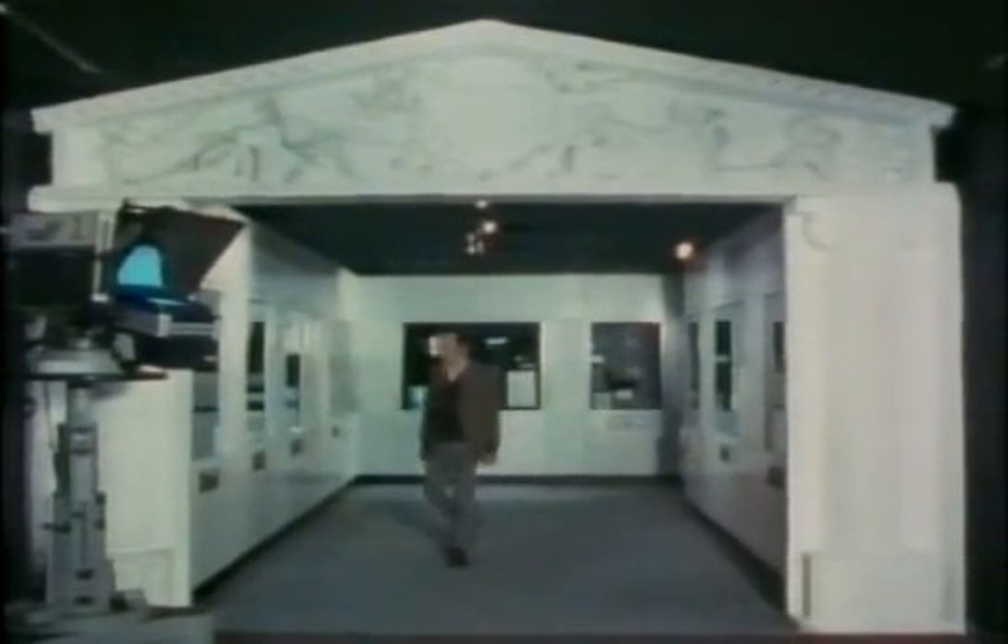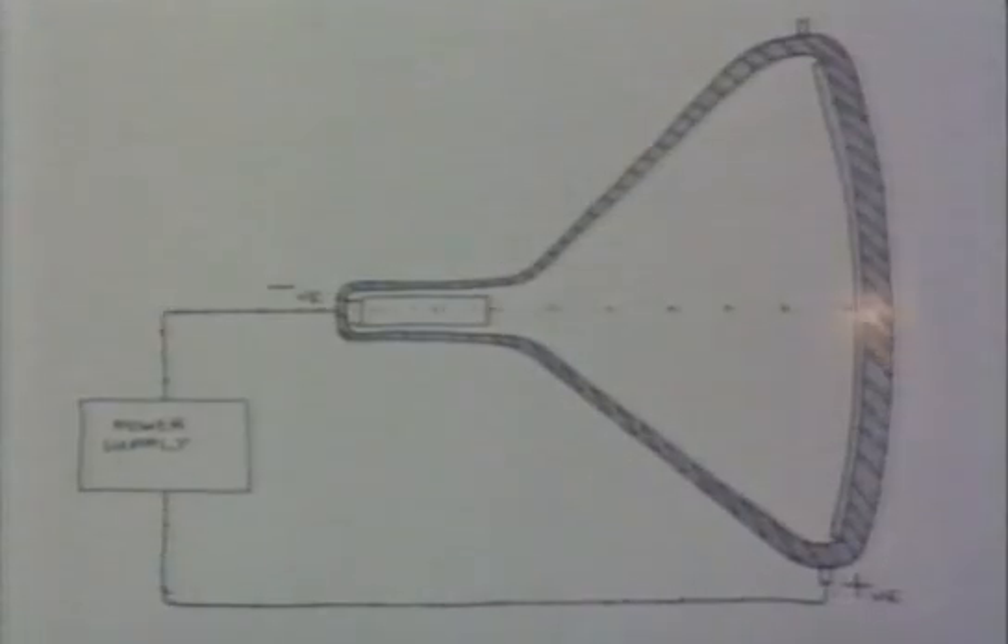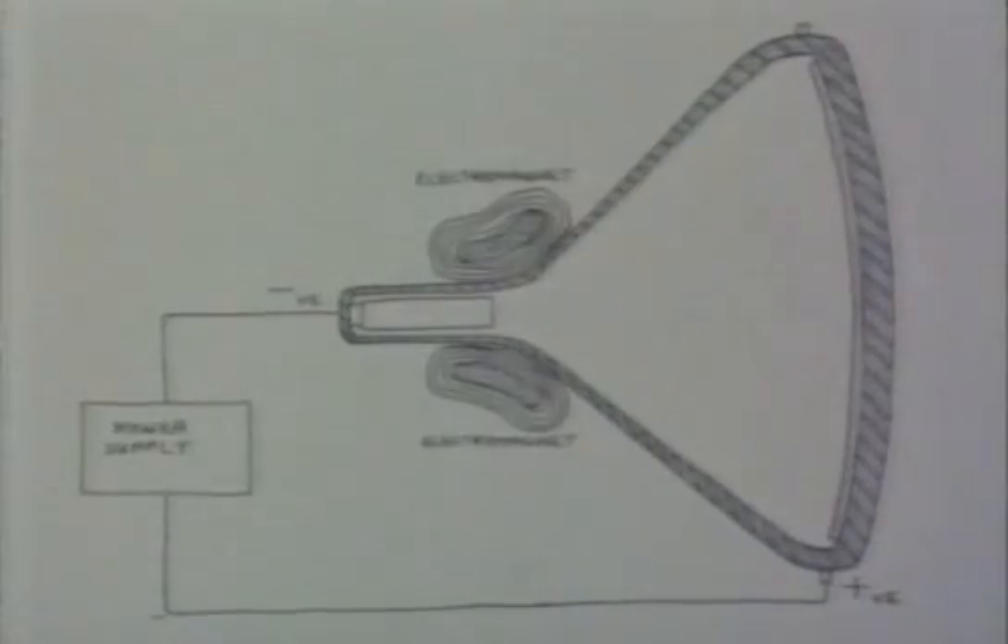This is the National Museum of Film Photography and Television in Bradford, and this part is all about how television works. I helped design it with the curators a few years ago. In this first display you can see the spot of light caused by the electrons hitting the phosphors on the back of the screen. If I hold a magnet over the screen, the spot moves because the beam of electrons is attracted by magnetism, and with an electromagnet strapped around the neck of the tube, the magnetic field can be very accurately controlled so the spot can be moved precisely anywhere on the screen.